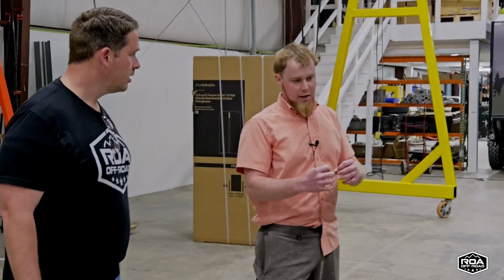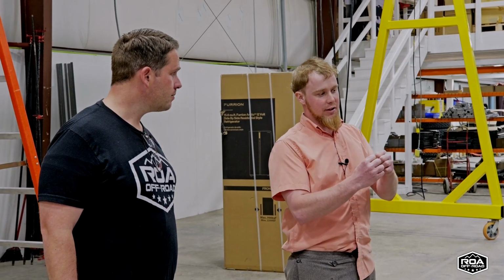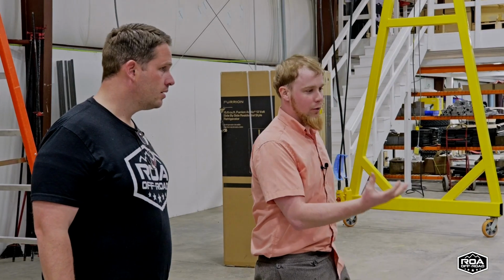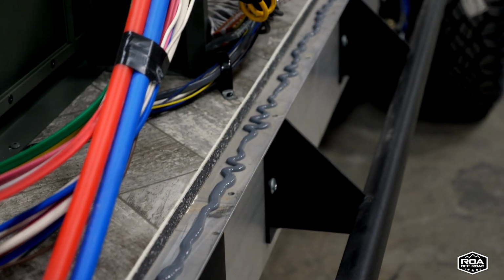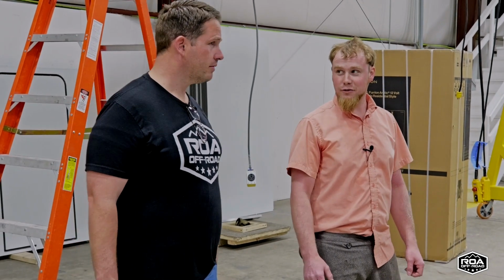Some epoxies, as soon as they get a little crack in them, bam, it's apart. This AP300 actually has a little flex, so you can flex back and forth. It's not a lot of flex, like you're not coming apart half an inch, but it won't break. It'll just keep holding on. It doesn't get brittle and break. That makes sense, that's what you want from these heavy duty adhesives. Adhesives are a great way to bond.